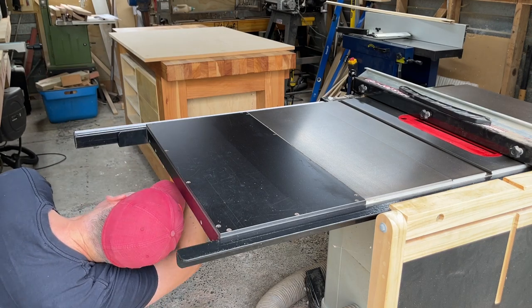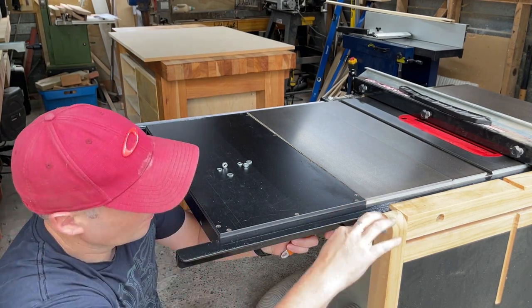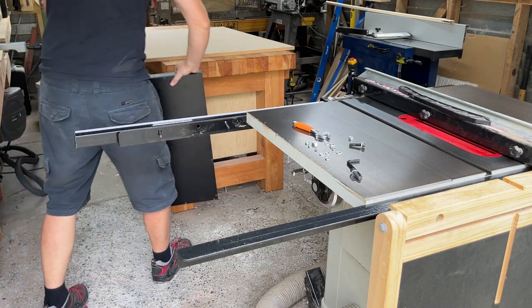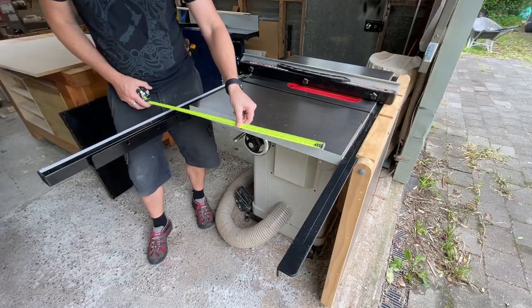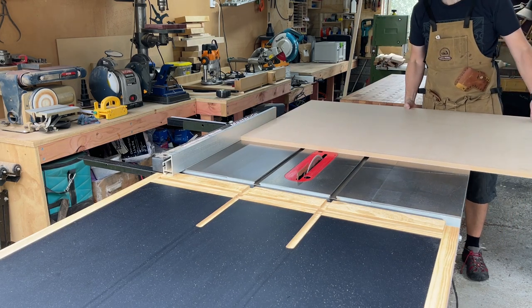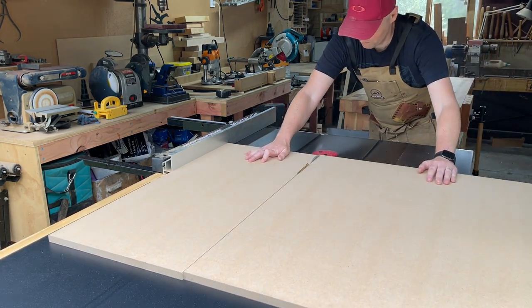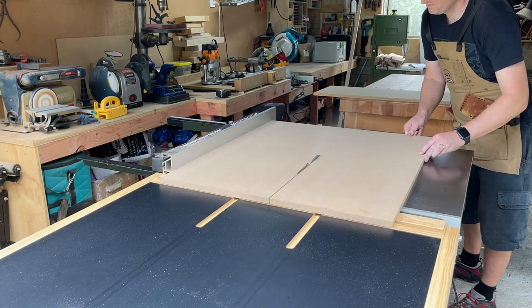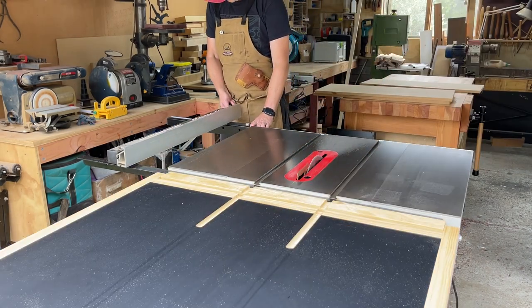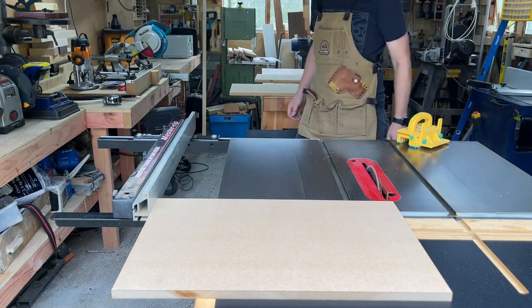The first thing we need to do is remove the existing leaf from the cabinet saw. This will allow us to make more accurate measurements of the space we have to work with. Mine was fairly easy as it was just attached with several allen bolts. I'm going to make the router table out of MDF with a frame of some cheap pine, so I take some measurements of the space and subtract the thickness of the frame to get the size of the main table. I then cut out two pieces of 18mm or three-quarter-inch MDF to the same dimensions, as I'm going to double them up for a thicker table. On the safety side of things, I forgot to wear a mask for the entire video when cutting this MDF — this isn't great as MDF dust is pretty bad, so don't make the same mistake I did.